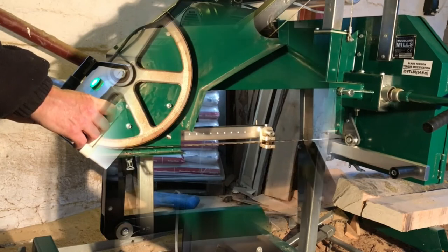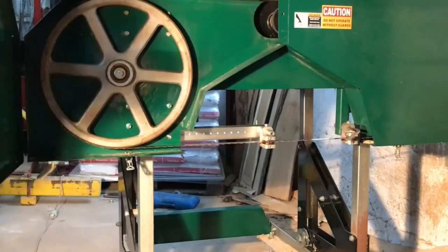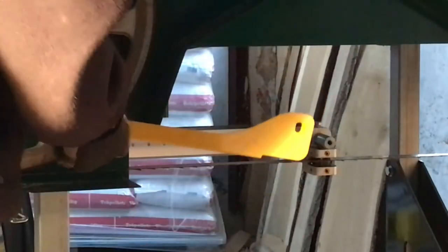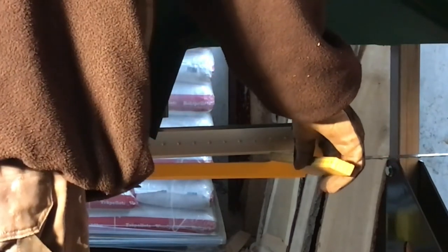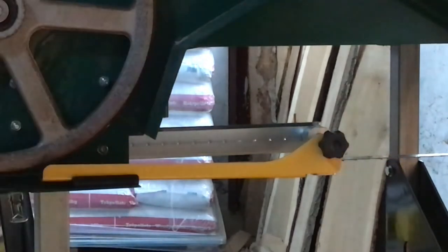So now it was time to put on the safety guard in front of the blade, the yellow part you probably remember from earlier. First I figured out where to put the guide that has to be screwed on the sawmill itself. You can see you have a finger nut you put on the shaft, and then you have the plastic guard you have to mount on the shield itself. I think I actually ended up having it just beside the edge, as you can see, and from the edge out was 15 millimeters.